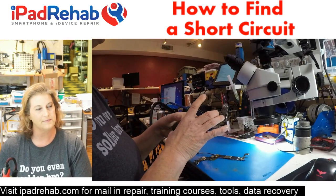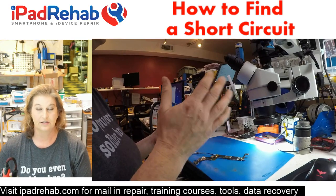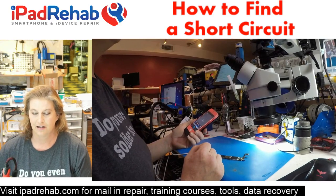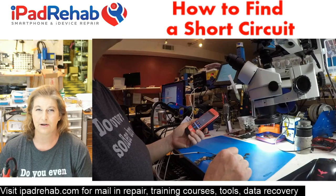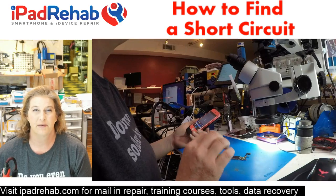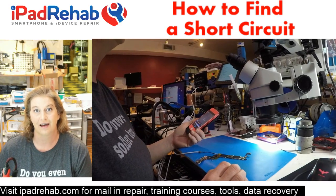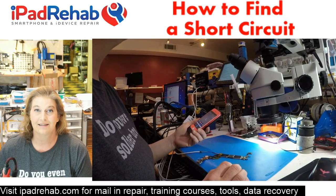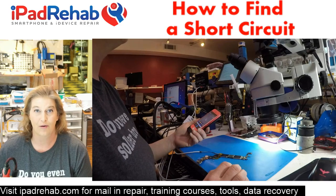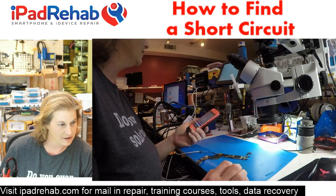And we can expect a short like that to generate some heat, so we can try to figure out where the short circuit is using heat. First, we can look at the board, and there's no visible signs of bad caps or corrosion. It's not a water damaged board. So whatever happened to this 6S, I don't know, but it does not have water damage. So we're looking for what line is short. We don't know, and then once we figure out the line, who's the bad guy, and see if we can figure that out.